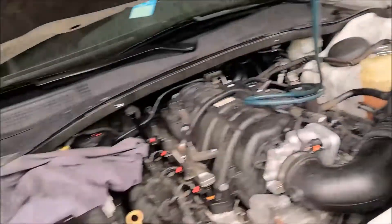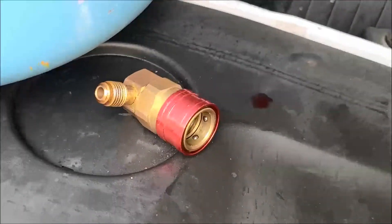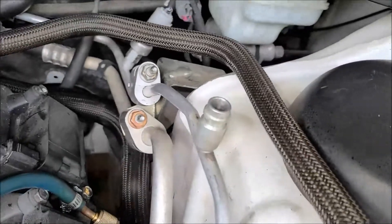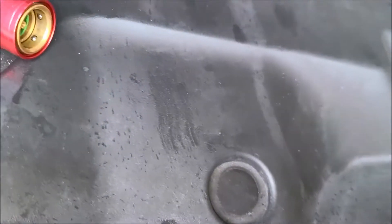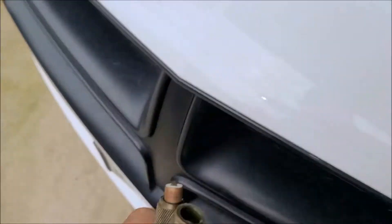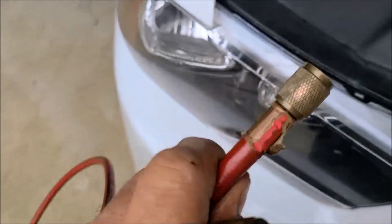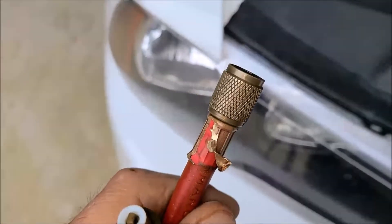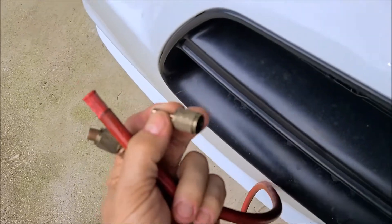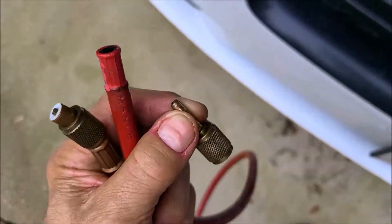It turns out yellow is different than red fittings — yellow is larger. So for me to put this end on, which connects to the oversized large high-pressure port, I'm either going to have to change that nipple out or change the fitting on the hose. What I did is I hit it with a grinding wheel on my bench grinder and cut it down. Now I need to peel that off and get that fitting out of there. It did come off — went flying on the ground, but we're going to blow it out with compressed air and use that in the yellow hose.